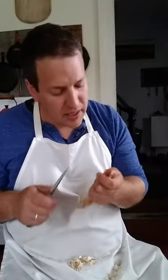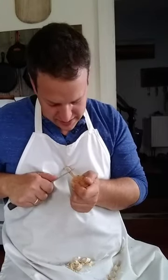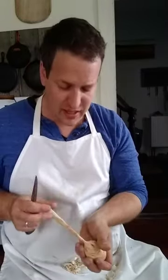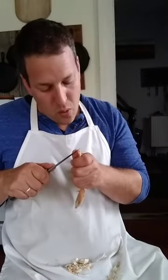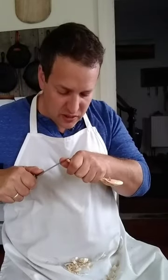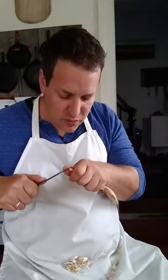I'm going to try to do your facets in one cut to add smoothness. I think it's worth trying, Lucas. You'll notice that, like on the back, I do a facet like this, and then when my hand touches my body, I hold it there, and I finish the facet like that. So yeah, the more you can do with one cut, the smoother you're gonna get. And obviously, there are limitations to all of that, but that's partly why I like this longer knife. The longer blade gives me greater running time before I reach the tip of the blade, and therefore I end up with smoother lines on my spoons.